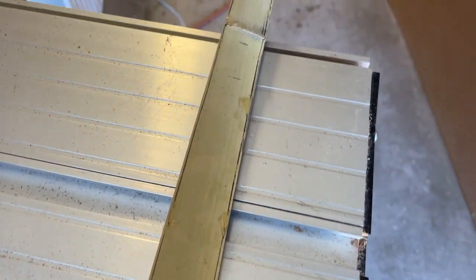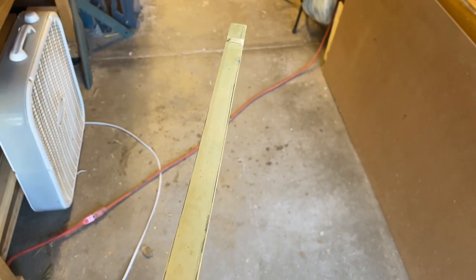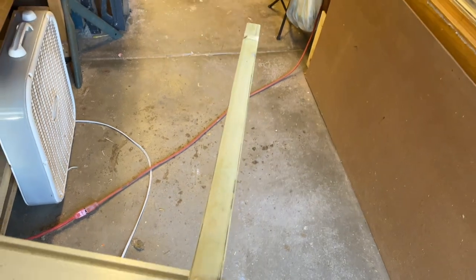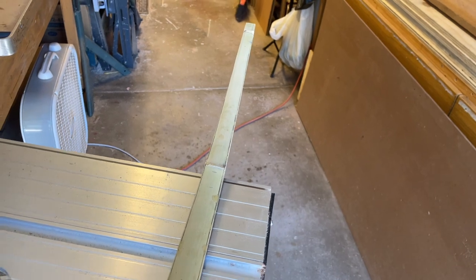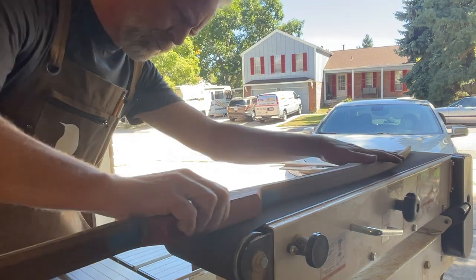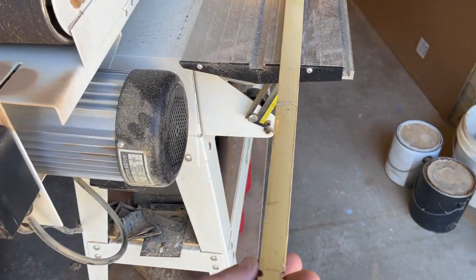But I want to really point out that as it goes down the limb and approaches the tip, that pencil line begins to disappear. I want to maintain the width out here at the tips for right now, because I want to be able to adjust should I need to narrow one side to true up the string alignment. All right, I have taken material off just to the lines.